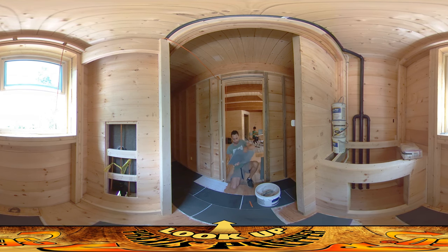I separated my tiles into two piles — the beautiful ones and the not so beautiful ones. These are natural stone tiles, so no two are alike, and some of them are not as beautiful as others. I wanted to make sure my nice ones are out in the open, and the not so nice ones either don't get used at all since I have more than I need, or they go underneath the washing machine. Whenever you get natural stone tile, separate them out at the beginning so you don't end up with an ugly one right in front of your door.